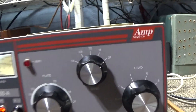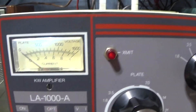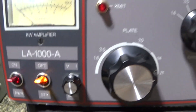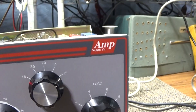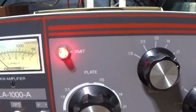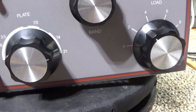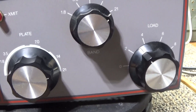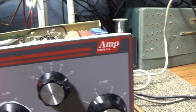Going to the 2000 watt scale and taking it off peak. Hitting the foot switch to fire up the amp - right there is voltage on the meter, and that's current showing zero with it on standby. When you key down with no drive there's just a little resting current. One thing about foot switches: you want to key the amp first, then key the mic. If you key the drive first and then key the amp, it switches on with power going into it - that's called hot switching, and you don't want to do that.